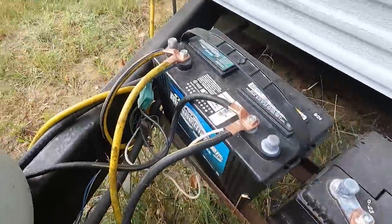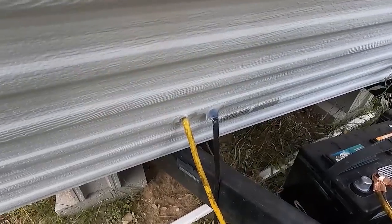Those battery cables look kind of strange — they were jumper cables. These ratcheting jumper cables I don't like, and battery cables are expensive, so we just threw some terminal ends on it. Now within the camper the two systems basically remain separate. It doesn't have its own inverter so I can't use the 12-volt to plug something in, so we got our own inverter — it's deep in the closet. This is a 2000-watt pure sine wave inverter with battery cables ran down through a hatch in the floor.